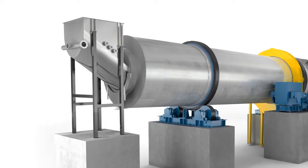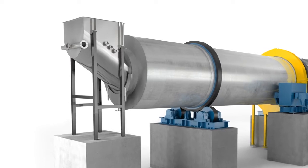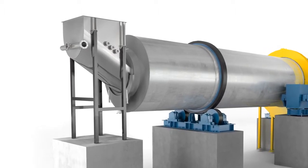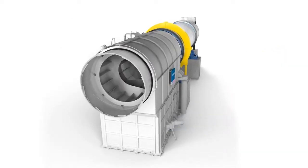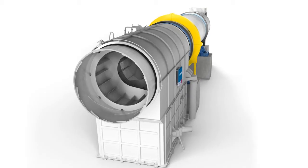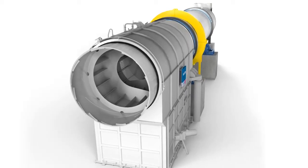Intensidrum has a maintenance-free and wear-free inlet chute and allows danger-free entry into the drum via the open reject outlet. An additional bundled water jet provides for immediate dilution of the suspension to 10–12% screening stock consistency.